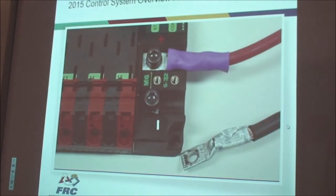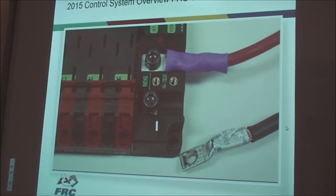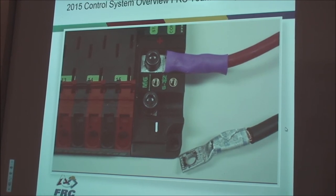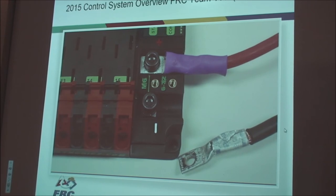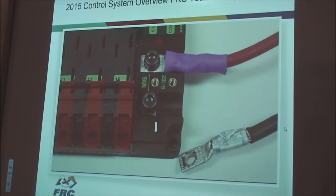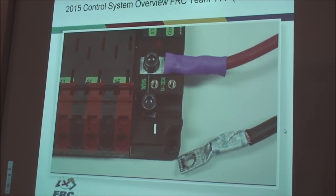The terminals are also smaller than last year, and the cover tends to be a bit restricted. This means that the copper battery connectors that have been given out in the parts do not fit, but the silver Burndy connectors that we use and are available anywhere do. We'll put a link to those in the description. We have yet to try other connectors, and this may or may not change in the final version that's been given to teams and its use given parts.